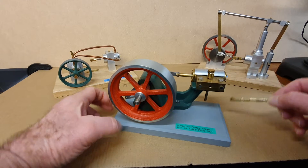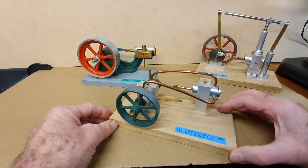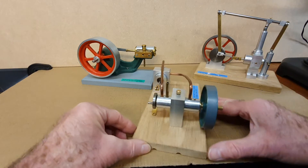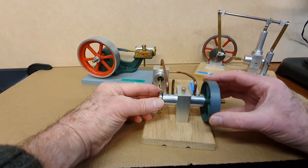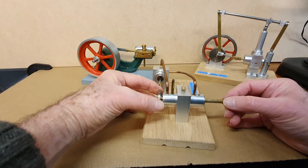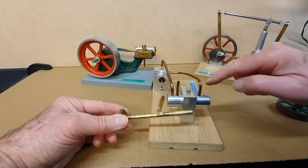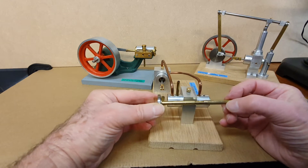The next engine I actually built was this one, and it's called a spool valve engine or rotary valve engine. On this one it's quite different in that the spool valve is actually attached to the shaft which carries the cam and the flywheel. I've already released the flywheel and the connecting bar from the cylinder and piston so I can pull this through. Here you have your air or steam inlet, the exhaust, and the air-steam path through to the cylinder.